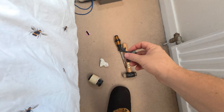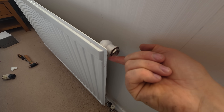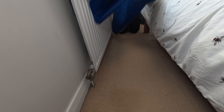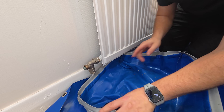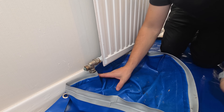That's running okay — we'll give it a bit of time, open the air vent up and then we should be good to go. A good check to see if it's draining is to put a spit on the finger and that should disappear just like that. With the air vent open this radiator is now draining, and I can start by prepping the floor, covering it all up as we're working over carpet. I like to use my De Blanc products — a big foldable mat, then trays and slides underneath to catch every single drip.